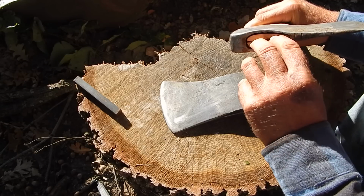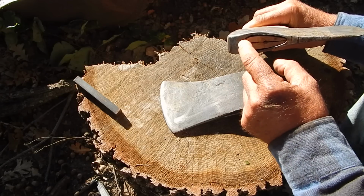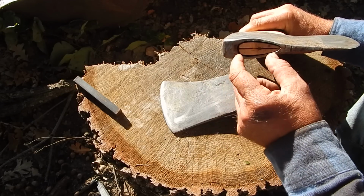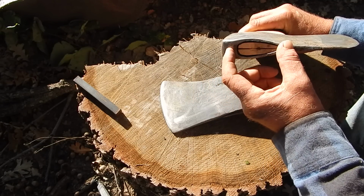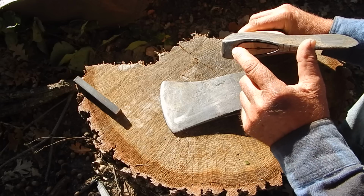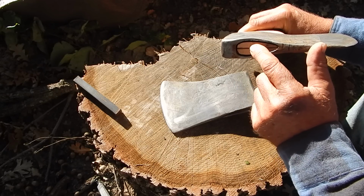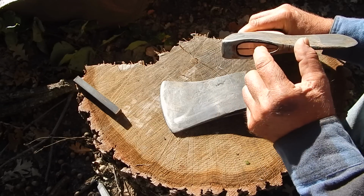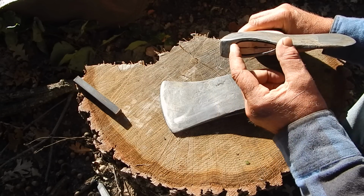Your wooden wedge will spread this completely out. But you always have to make sure that the wedge is long. A lot of times I'll cut the wedge so it's narrower at the bottom than it is at the top, and even let it splinter as it goes in, the top part, because you got to fill that space. This will simply fill the sides, the wedge fills end to end, then you put your steel wedge in to really tighten that up.